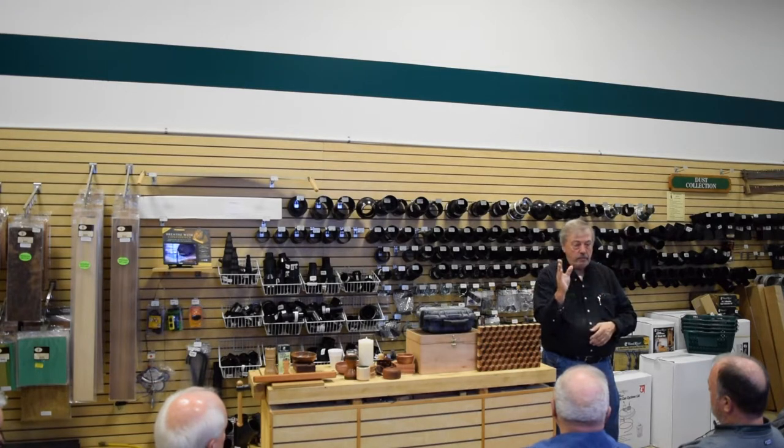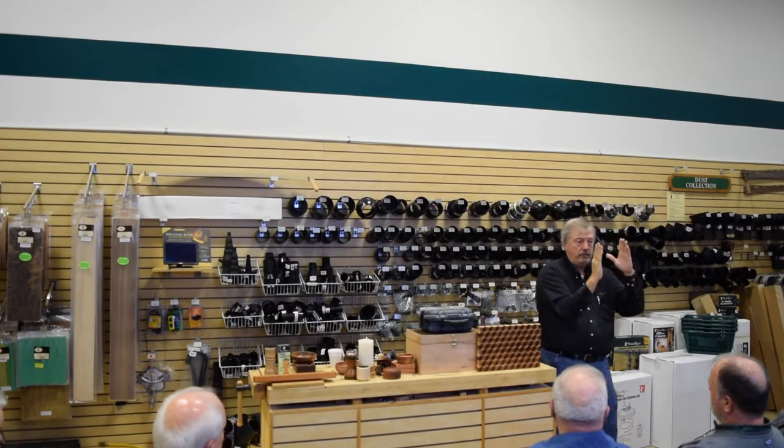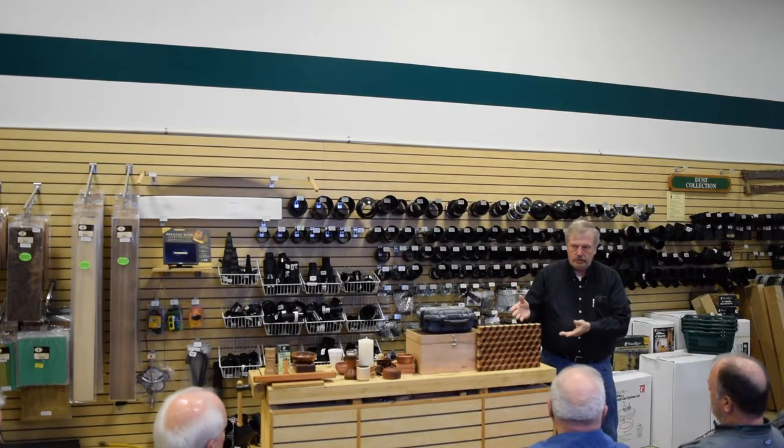Then you're going to take your table saw and set it to 90 degrees. And everything that's like this, you're going to cut those so they're like this. And now you have the beginnings of these things. Now you chop them up, glue them back together, and this is what you get. But to make this work, you do need table saws and joiners and planers, because this is a tight fit. This is a demo type of fit, so the tolerances aren't as great as they could be, but it still looks pretty. And unless you really looked at it hard, you'll never see that. So this is something that's capable in your shop if you have those basic tools.